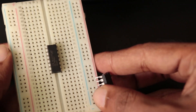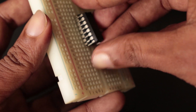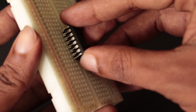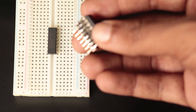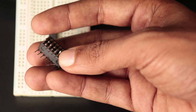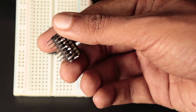My solution was pretty simple — put one on top of the other and solder them in parallel. Yes, a high current DC motor driver. Believe me guys, it worked like a charm. L293D piggyback configuration is an easy way to double — or in my case triple — the current as well as the power of the L293D motor driver IC to drive high torque or high current DC motors. It is a speedy and simple technique to double the current output of the L293D IC.